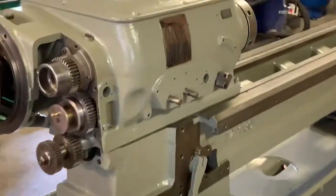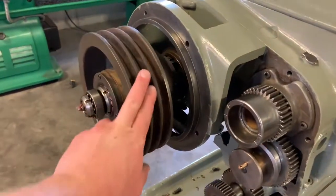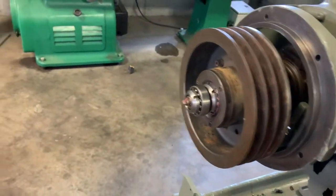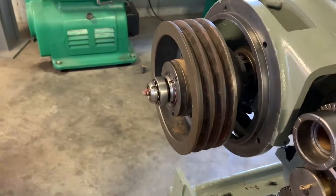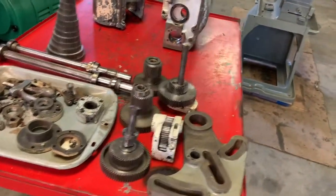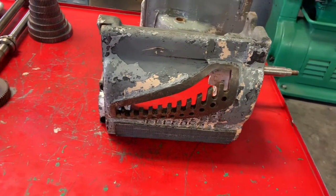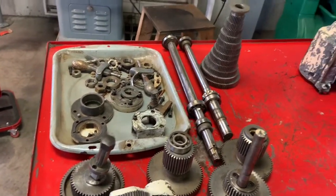As far as the rest of the stuff and the lathe project, I made a little headway — that's how it sits right now. The input pulley, I finally got it sorted out. I was missing a nut to go on the end and I actually found it in the end casing — it had unscrewed itself and boogered up the threads. I used a thread file and got that taken care of. Kind of doing it between working on the tractor and waiting on parts — I got the quick change gearbox off, power washed it, degreased it, it just needs wire brushing. I got all the internals ran through the parts washer so it's ready to go back together.